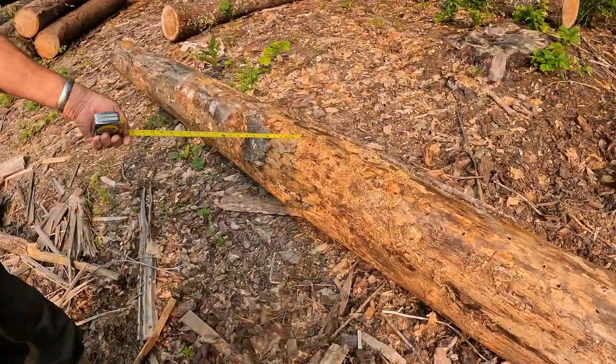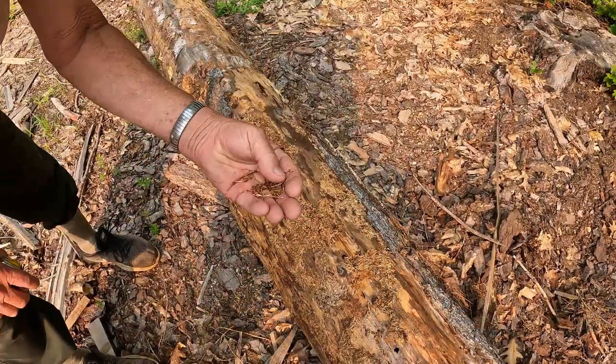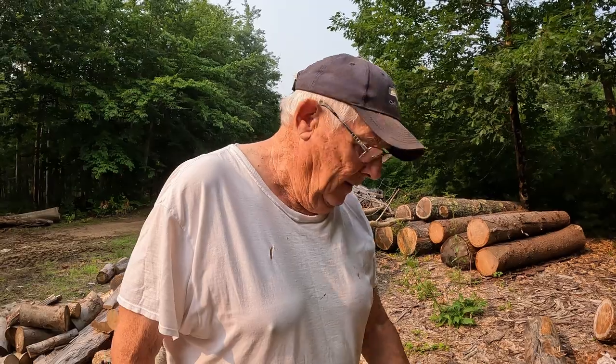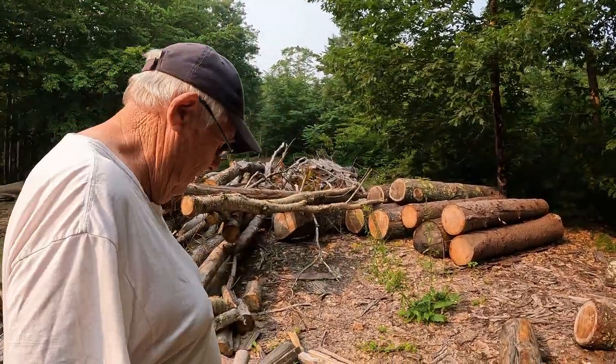We can show you what they do — they're pretty awful. Here's a good example. You can see all the borings here — they drill these holes and lay their eggs for the next year. They're ugly-looking things and they can probably bite you pretty good too. You can't keep your logs down very long. I've noticed that some sawmills in the summertime, when the bugs hatch and start boring, will water down — keep water constantly on the logs until they saw them — and that keeps the bugs away.